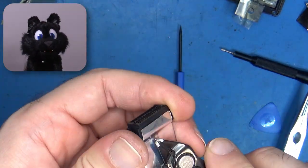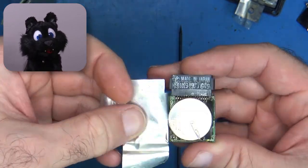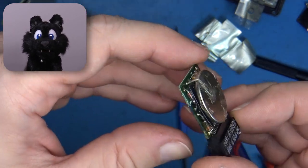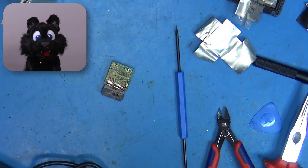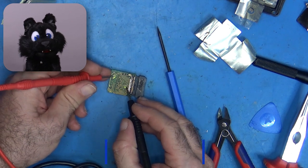The memory module I got with it is the 8KB RAM version. It does come with a 3V battery inside, so it acts as a storage device. But as can be expected, the battery was well below any useful voltage. I found a suitable replacement cell that only needed minor footprint adjustments.